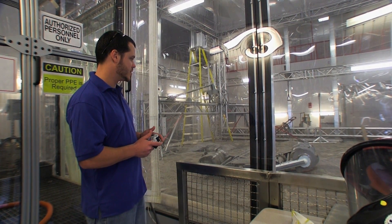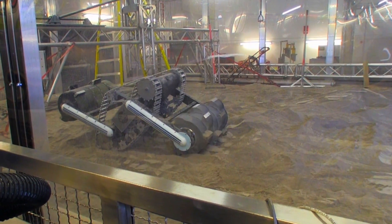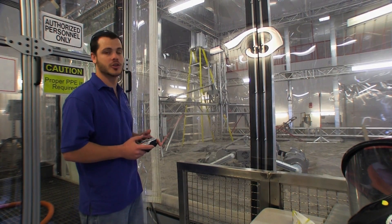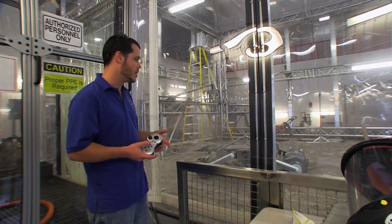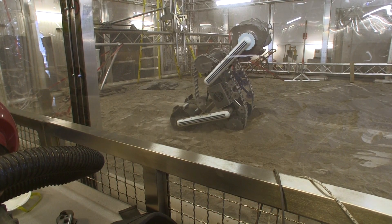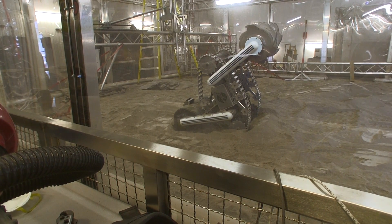We also have the capability to raise and lower the robot with the arms — we can actually raise it up off the ground entirely. From there, if you've got a rock stuck in your track or something wrong with the mobility system, you can run your tracks free in the air and clear the dirt out. We can also use the arms to stand the robot up in a Z position on a drum and tracks, which lets us climb over different obstacles.